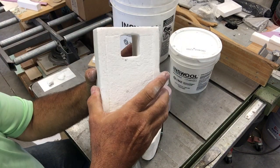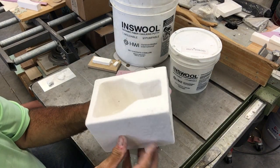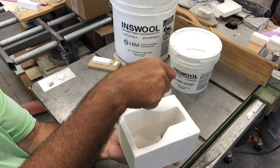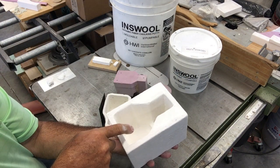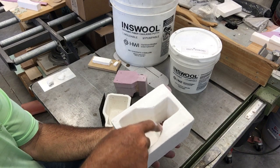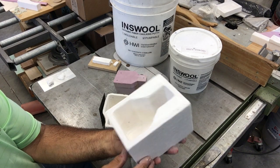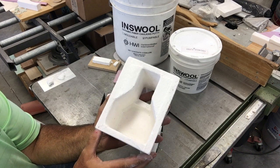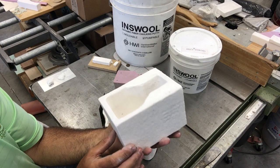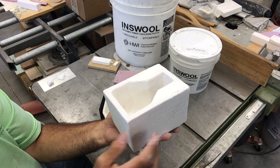This one is made to receive a one and a half inch square sprue. I'm going to do a large pour with it and haven't made the steel cradle yet, but the cradle will probably surround it and have a little hinged handle to pull it out of the sand. Just this cup area holds about five and a half pounds of aluminum, plus about another 1.2 pounds in the sprue area — so if full there'd be over six pounds of molten aluminum. I made this one for a 40-pound pour I'll be doing in the future.